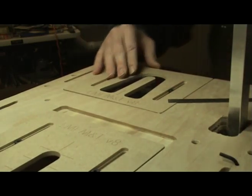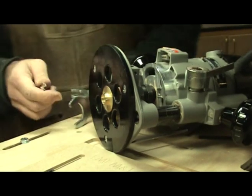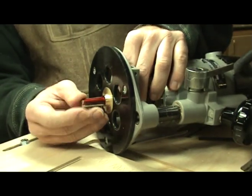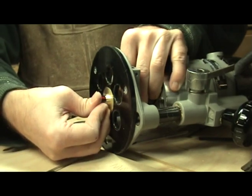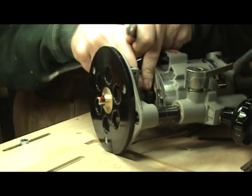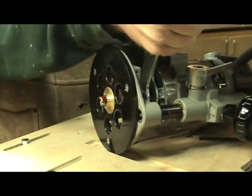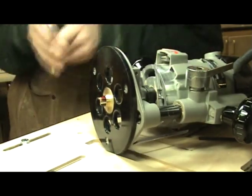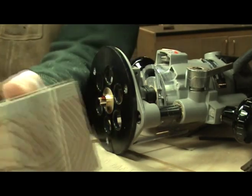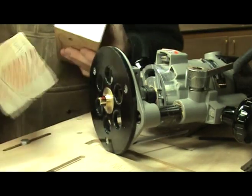And coming in, use your straight cut bit to make the cut. For doing the mortise and tenon cut, I use the 5/8 inch outside diameter guide bushing again with a 1/2 inch straight cut bit. Make sure that it is tight so that you have no surprises when making the cut. Now, since I have test pieces, all I need to do is cut that off of my chop saw, and I can use these pieces again.